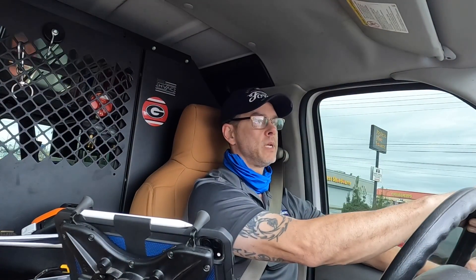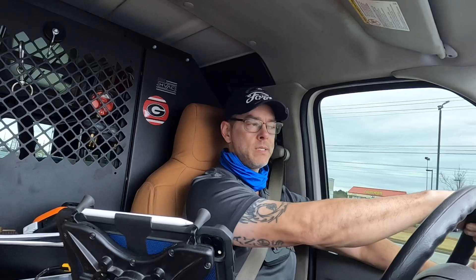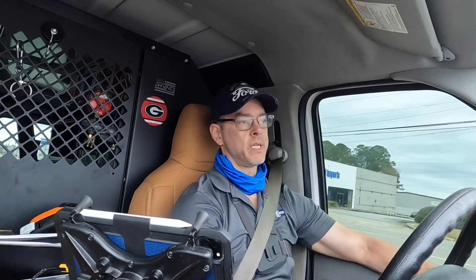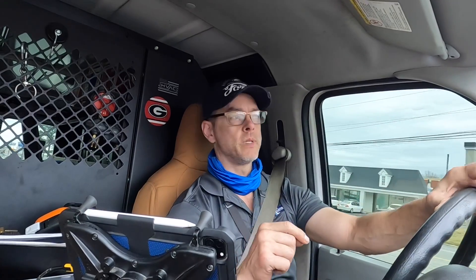On that one I did stick around and check pressures and heat and cool. Clearly that condenser fan motor was not running when I walked up on it — if I didn't show that very well, I apologize. But I'm hesitant to just go pick up a new board because I've seen new boards do the exact same thing, so I don't feel like I'd be fixing anything. We're just going to watch it, and if it happens again then I'll replace the board. Thanks for watching guys, I'm on to the next and I will see you on the next video.